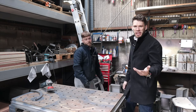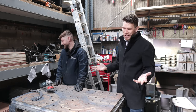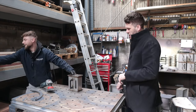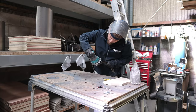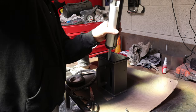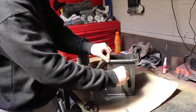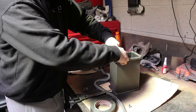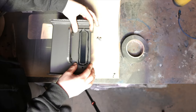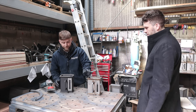One of the unique parts of these stoves, the bit that I get excited about, is the coffee pot — it's affectionately called the coffee pot. Carl puts them together and I just get it in that raw surface state. I paint them — the outside and inside — then put the rope seal on. These get wire brushed as well, exactly the same as the fires. Everything's just cleaned up nice beforehand because if you don't, it just shows up on the paint, so it makes for a nice job.